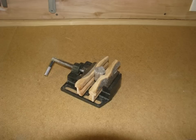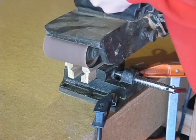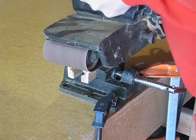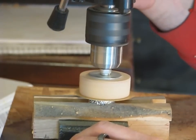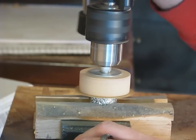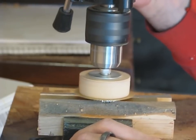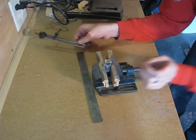After allowing plenty of time for cooling, I came back and shook out the rough casting. Then I clamped it in my drill press vise with some homemade V-blocks. I used my belt sander to roughly square the end. Next, using a homemade disc sanding attachment on my drill press, I squared and smoothed the end. Then I marked the approximate center with my dividers and center punched it.